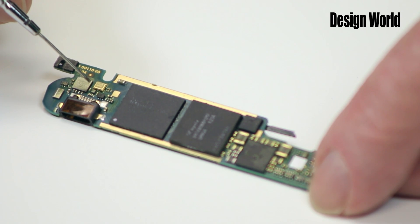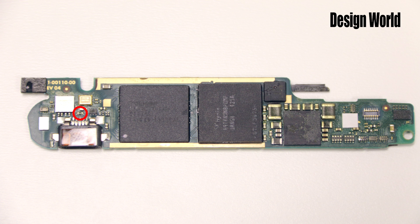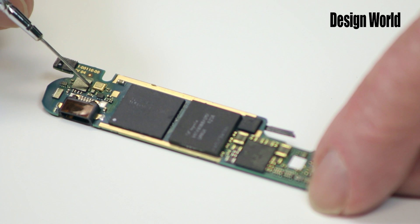One other component we noticed on the main board was a 435 series surface mount thin film fuse, from LittleFuse. There's a marking code on its top surface that seems to indicate this one is rated to handle 2 amps at 35 volts in normal operation. Now these fuses are obviously tiny, which is why they're often found in applications such as handheld portable electronic devices. They're designed to open in less than five seconds when they see 200% overload. 200% overload for this device would be something like 4 amps, and looking at the time-to-open curve on its data sheet, you see that on average it'll open up in a few tenths of a second at that level.